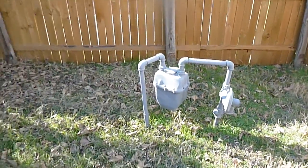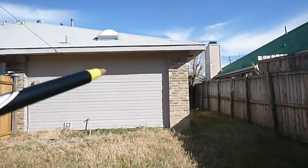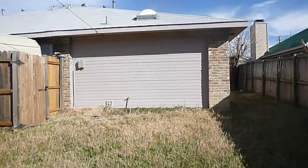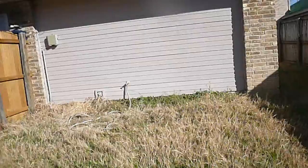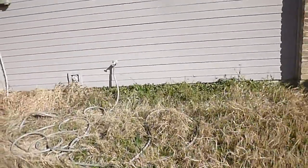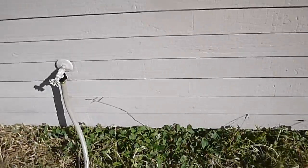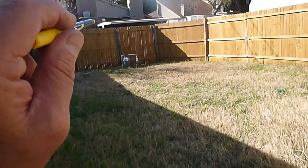This is the second structure, third unit. The second structure is different from the first in that we have some siding, and the garages have been converted. They still have skylights. I've already been on the roof. The exterior faucets, front and back, neither one has vacuum breakers. The faucet on the front is missing its handle, and it's 55 psi to this house.